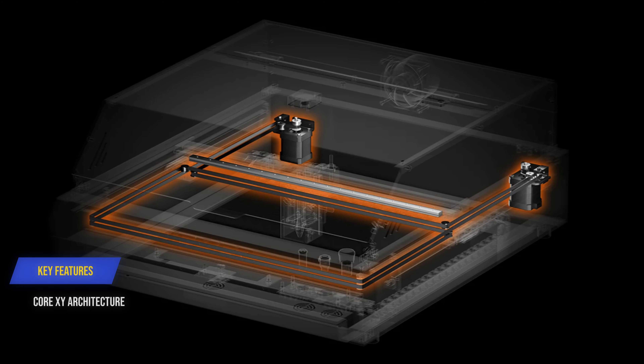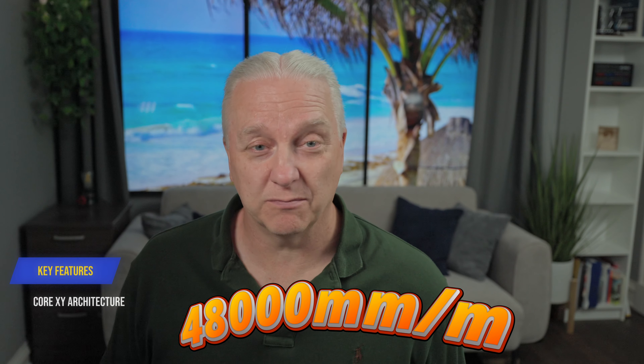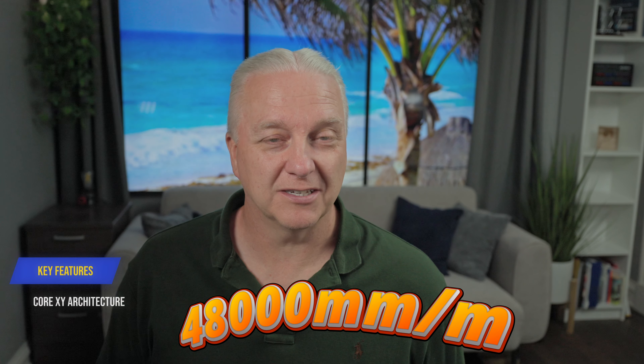By contrast, the architecture here is called Core XY, and the P3 uses just two stepper motors to move everything around. Both stepper motors control the y-axis as well as the x-axis, so there's no additional stepper motor on the gantry — that makes it lighter. Those stepper motors can very accurately control the position of the laser head anywhere on the workspace, so a circle is more or less truly a circle. Not only do you get better accuracy, you also get better speed — the maximum speed for the P3 is 48,000 millimeters per minute. That's a smoking fast laser and I've pushed this a bit and it works really well.